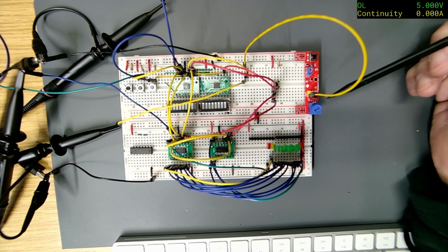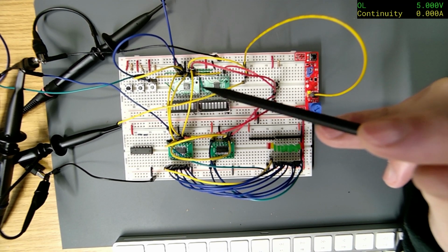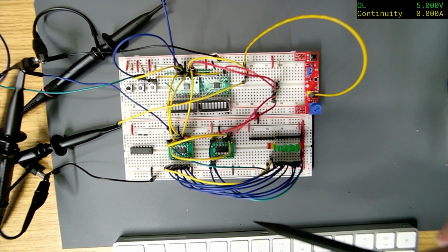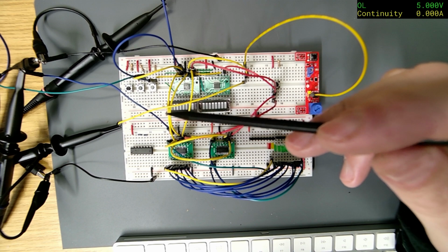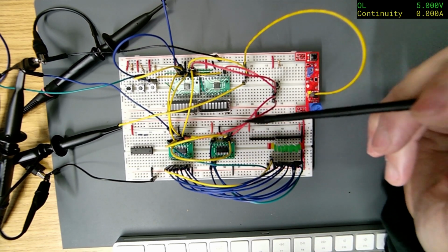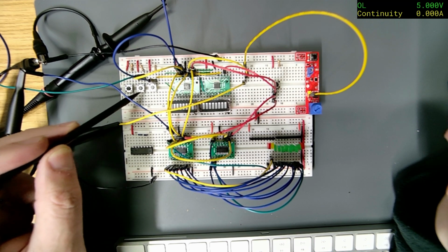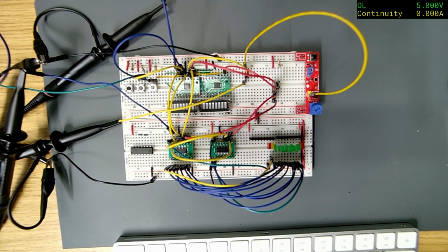Okay, so I've got the clock. So the clock is doing the shift clock. Let me make sure I've got that right. Yeah, so it's doing pin 11, which is the shift register clock input. So that's the bit that moves the stuff, as I would imagine. So then for the register clock on both of them, these are the ones that we've got the issues with. These are the new ones that I tested earlier with the yellow bottoms. So the shift clock is on this button here, the middle button, and then the data input is on this one. So I press this, it just sends a one in, or more than one, depending on how fast it's going. So it's not behaving. I'll show you what I mean. Where's the power?